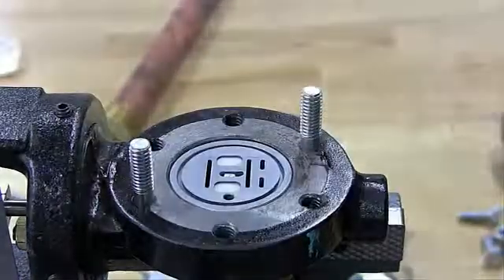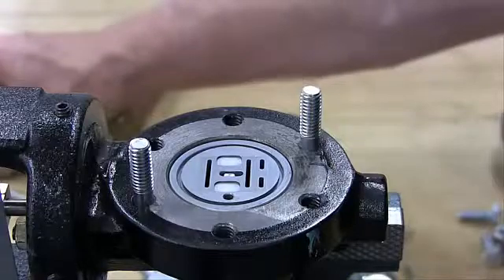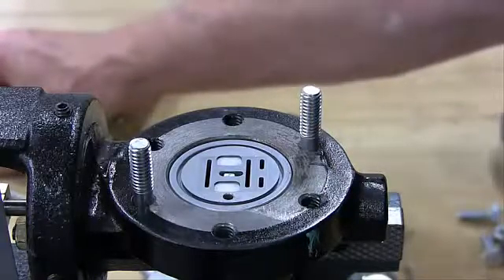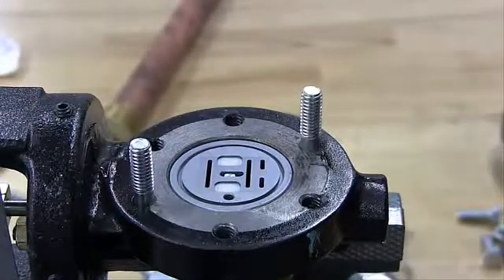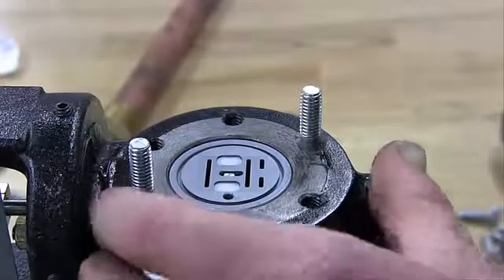Protect the lapped surface on both sides of the disc guide. Improper handling of seats will result in leakage or flow control issues. It is imperative that the disc pin not be rotated when disassembling, cleaning, or reassembling, since this affects the stroke adjustment.